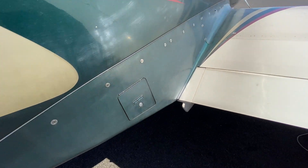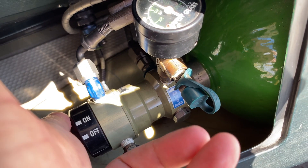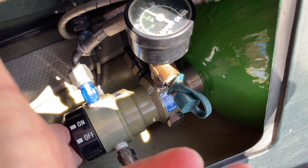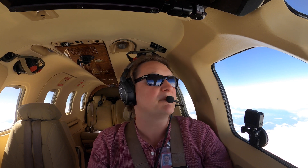With regards to the pre-flight for the oxygen system on board the aircraft, there are several things that we test and ensure. Firstly the external valve and the pressure on the outside of the airplane — we want to make sure the valve is in the on position and that there's enough pressure for our intended flight. Things that determine how much pressure is required for dispatch include how many people are on board, how high I'm flying, and how long I'll need to maintain altitude if over water on a fuel-critical sector.